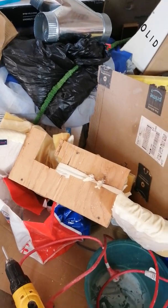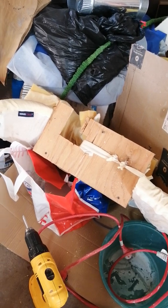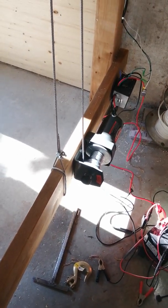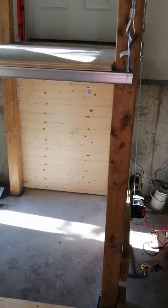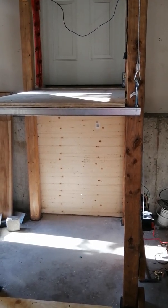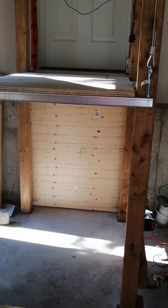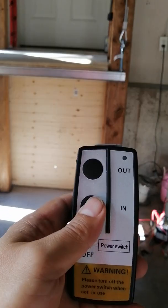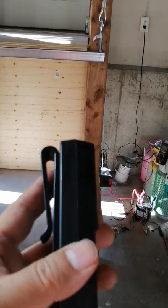I made a little box with foam to cover the winch, hopefully to reduce the noise. The lift travels about 1.4 meters. I placed the switch down low to make it easy for people to operate.